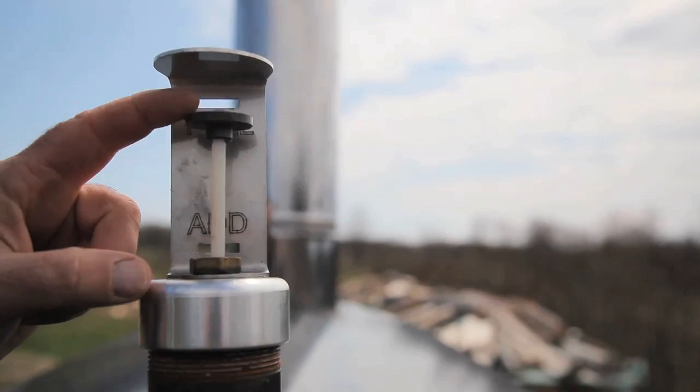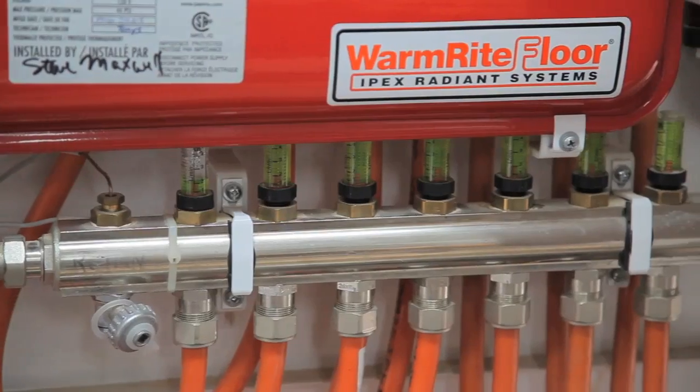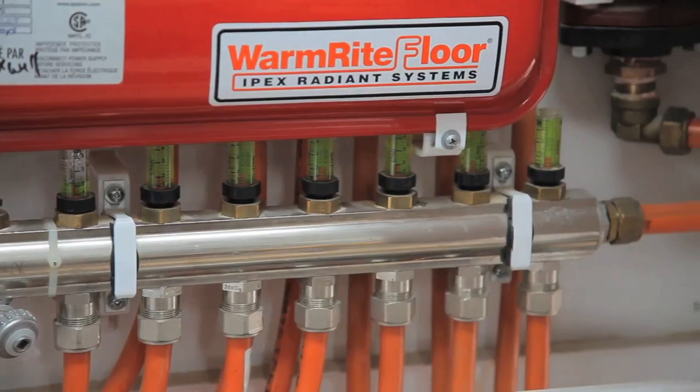That water is then circulated to neighboring buildings, where it delivers its heat energy for space heating and domestic hot water production. That hot water can be used in radiators, in-floor heating networks, or run through the plenum of a forced air furnace to deliver that heat through heating ducts. In the case of my own house, I've just retrofitted it with hydronic in-floor heating lines and antique cast iron rads because I didn't build the place originally with heating ducts of any kind.